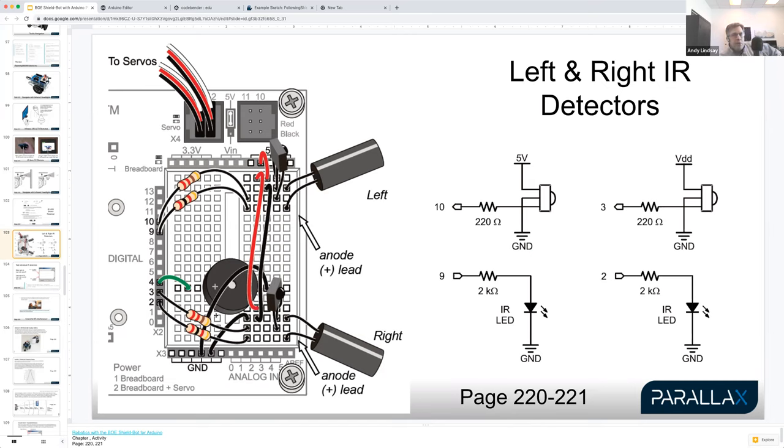So it's time to disconnect your whiskers. You can take everything off, so we'll want to take our whiskers off. Unscrew slightly each of these front screws and take the whiskers off. Then leave the piezo speaker and its wires on, but take the rest of the whisker circuit off and then go ahead and build up this one.